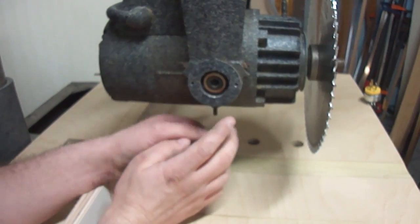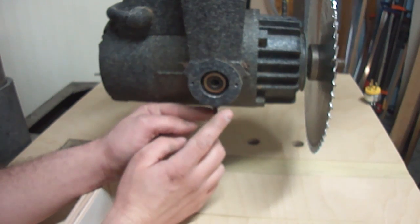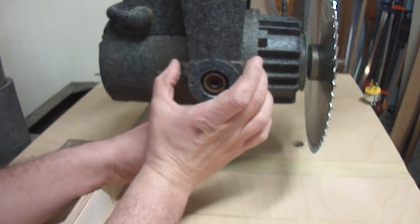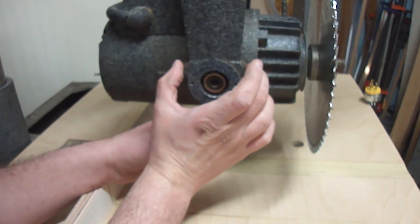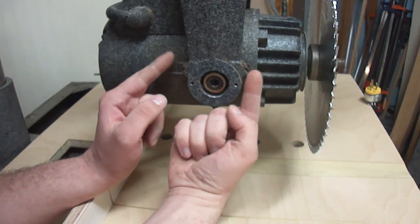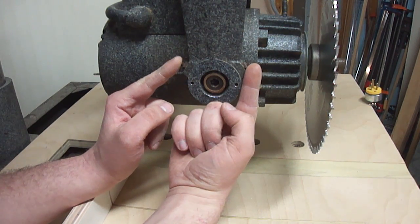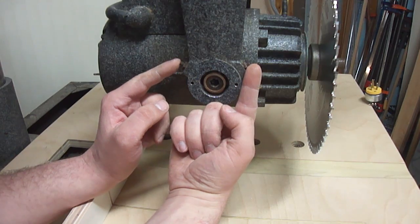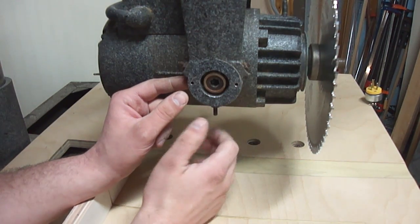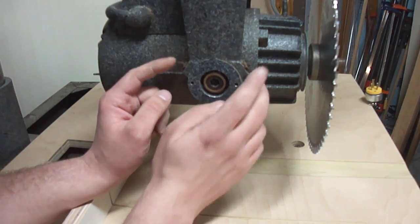What we want to do is adjust the horizontal heel first, because adjusting the horizontal heel requires moving these 2 set screws, which is going to throw off the vertical heel. No matter how careful we try to move these screws, we're never going to get them back in the same spot, and when we're talking about thousandths of an inch out of whack having a significant effect on the quality of the cut, we want to get it right.